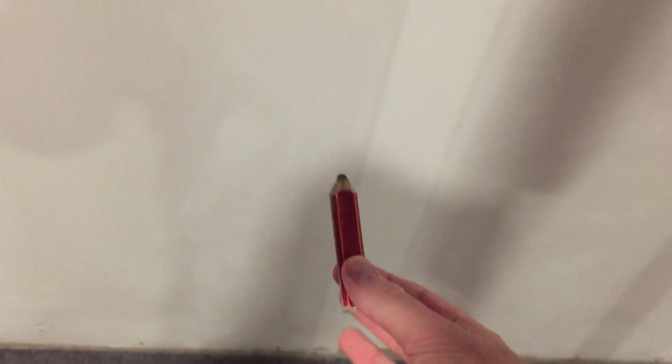So what I like to do is I'll have a pencil nearby. This one's just a carpenter's pencil. And I'll go around and I'll circle things. Like you can see here, a screw that missed. I thought the stud was there for whatever reason. And it's gonna be a bugger when, well, it was a bugger when I was sanding, but chances are it could be exposed even when I put the baseboard on. So I gotta decide whether I'm gonna fill that hole or not.